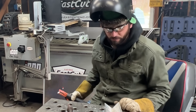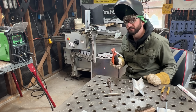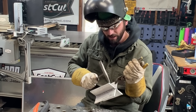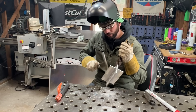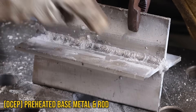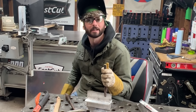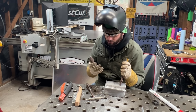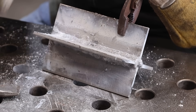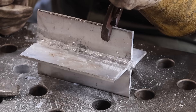It's so hard to see the edges of your puddle. Giving that rod a little bit of preheat and having already had a lot more heat into the metal definitely made that rod feel a little more like it was supposed to be — at least acting right. When your slag is really tough to come off, it usually tells you you've probably done something a little crappy. I just absolutely hate this process. We had some good weld here, but the back end doesn't look like we have anything even worth testing — it was just stirring like a liquid pool. You'd clean it out as best you can, get all that slag out trapped in the corners with a wire brush, wire wheel, and maybe some grinding if you had to put multi-pass welds on there.